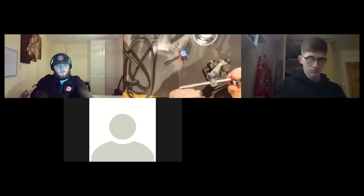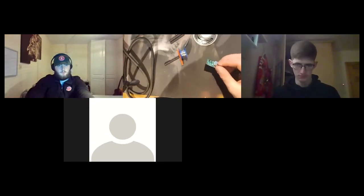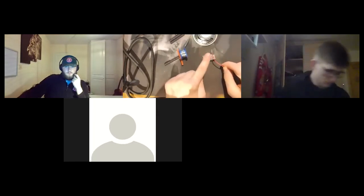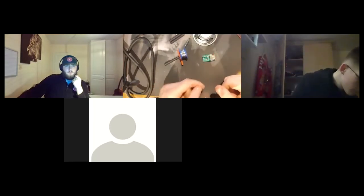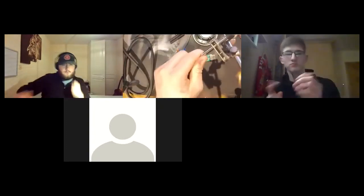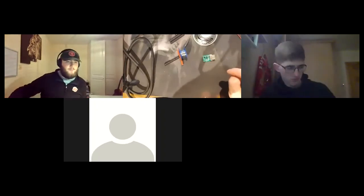I'd recommend trying to pick one of these up. It won't really work for what we're doing now because we're not soldering two leads, we're soldering ICs. But I think you can get these for like a tenner on Amazon. They're well worth it because the heat will also go up the cable you're soldering. So I'm holding this and I'm soldering the end of this, and the heat goes the whole way up and will scald your hand. So things to pick up for soldering: a soldering iron, heat shrink tubing, a jeweler's clamp, something like this, and that's it really. After that, you're ready to go.